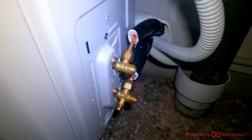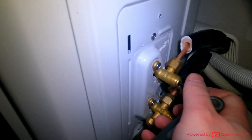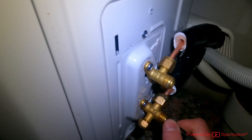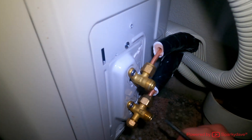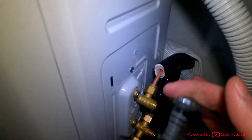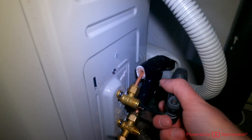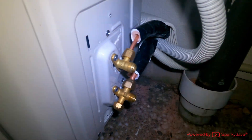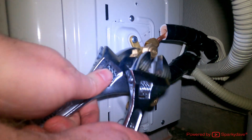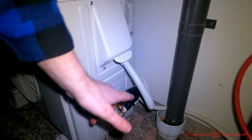Cap the end of the pipe and then incrementally release both sides. Open both valves all the way and then half a turn back — this prevents them from getting seized in the future. Put the caps on really securely. That's now commissioned.